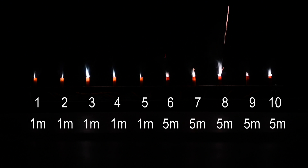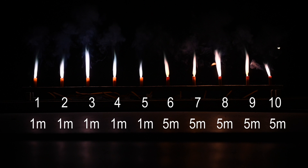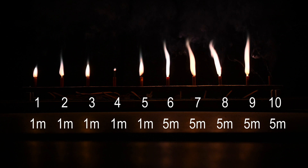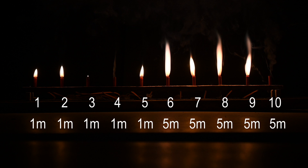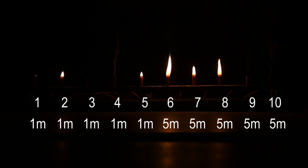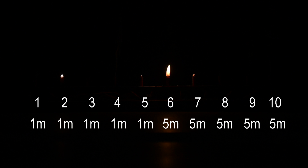Let's look again in slow motion at the second bank. Numbers one to five were from a one-metre batch and six to ten were from a five-metre batch. Check out number ten — as well as being very weedy, it also goes out very quickly. Number three seems to be doing a good job, but the five-metre ones do seem to have a bigger flame than the one-metre ones, with the exception of ten. You can also see a variation in burn time, with some burning for a lot longer than others. To my eyes, igniters one to five seem to have a slightly bluer flame than six to ten, possibly indicating a slightly different composition or a different factory.